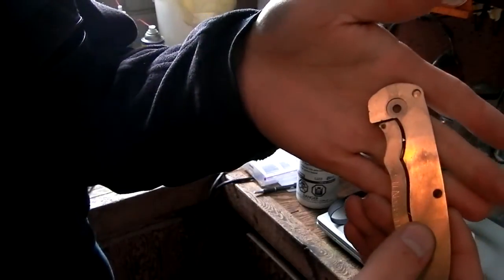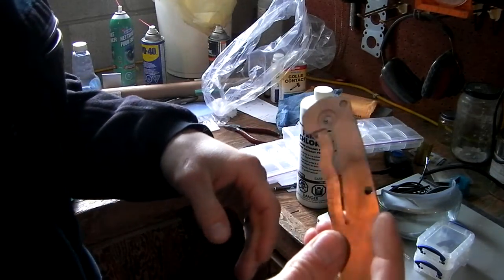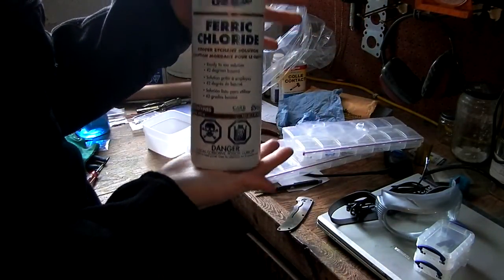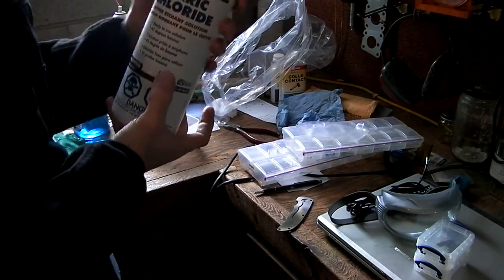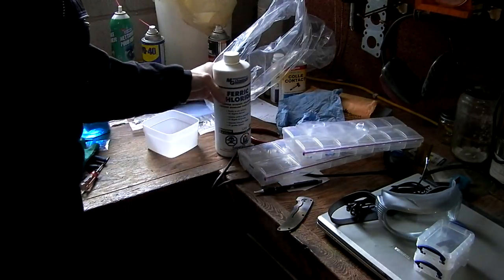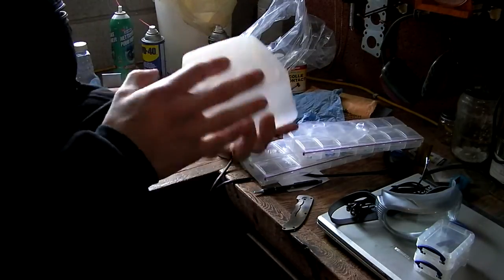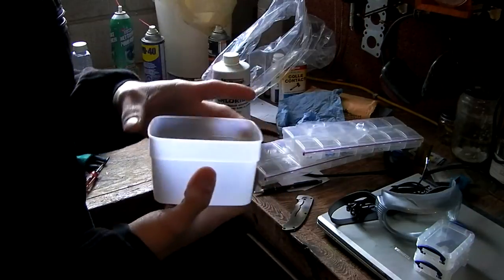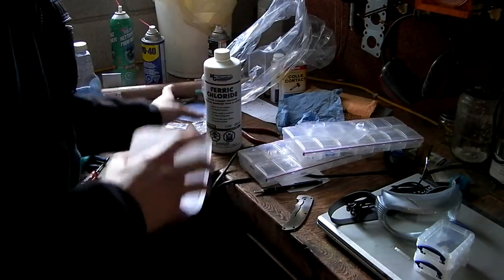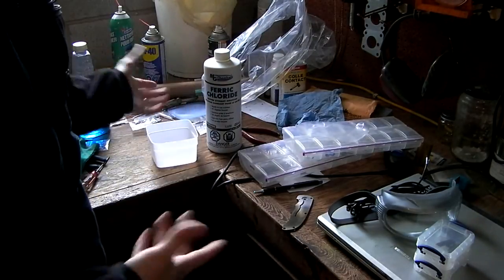Since muriatic acid did not work to get the ball out and it totally screwed up my anodizing, I'm going to use what everybody says to use — ferric chloride. I got this for about $12, a liter or a U.S. quart, at my local electronics store. This place is like a Radio Shack on steroids, but apparently Radio Shack has it too, and this much is probably going to last me forever. I have a little plastic container — look on the bottom and see it's number two. I know that two is chemical safe; it's what I use for all my other acids. I'll use the same just to be safe. Dangerous chemicals will kill you — rubber gloves, chemical-safe gloves, put your eyes on.